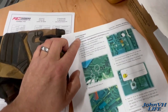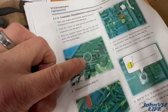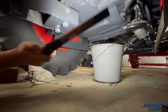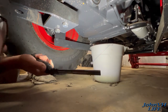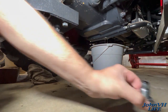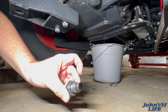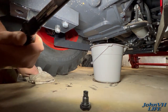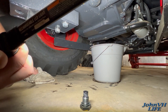Looking at the manual - now granted this is a 3015 manual, but it should be the same tractor. Mine doesn't have that second plug. According to the manual there's supposed to be another plug on the front side of the transmission, but mine doesn't have it. That part is pretty much drained out. Doing some research, it appears they do not have the second plug - if someone has ever found that let me know, but it's definitely not where the manual says. Something to keep in mind if you're looking for it.